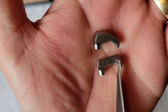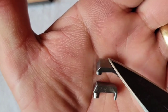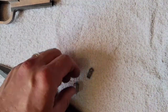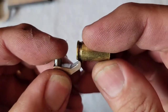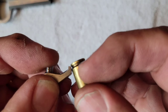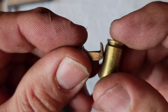The distance from here to here is the same between the two. Where they mostly differ, and what makes this one better, is this area cleared back here. So when the casing is withdrawn from the chamber, it contacts the ejector and is pushed out. And as it makes that turn, it doesn't hit this surface here.